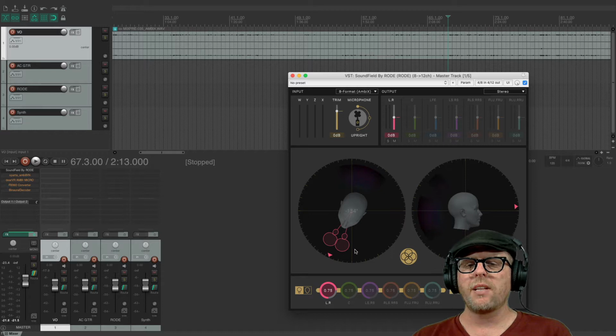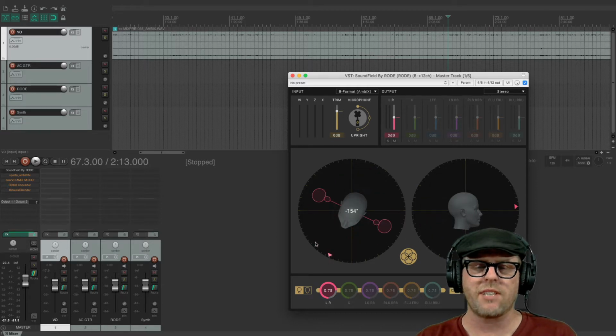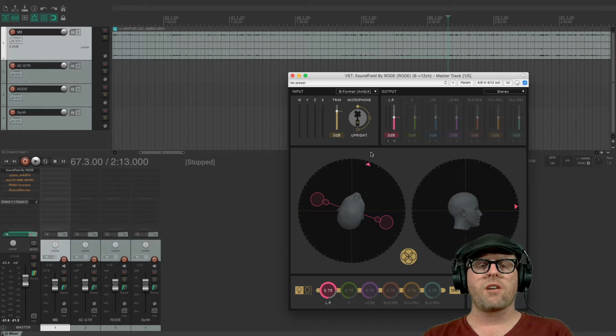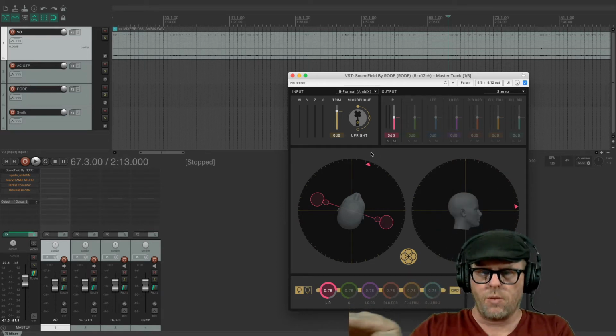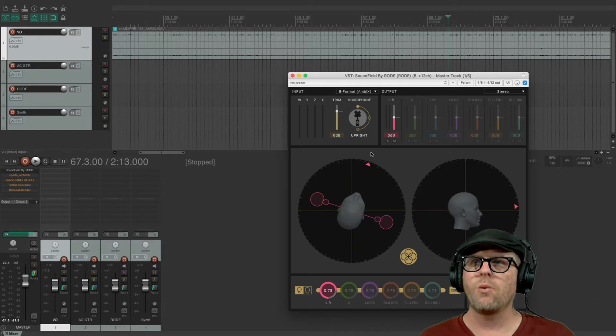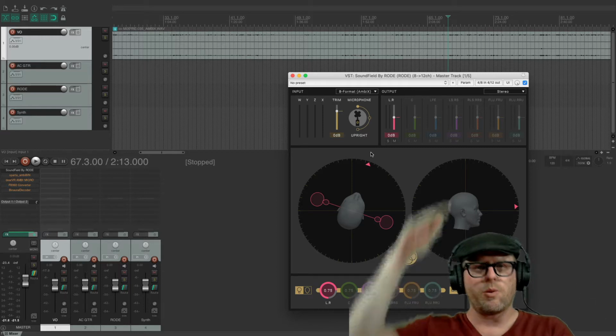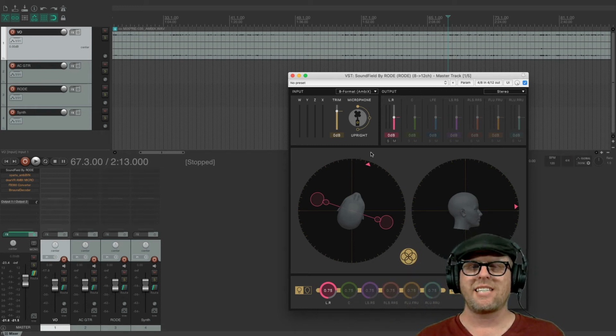So we have the ability to change the position and the polar pattern. What's cool, and I'm really excited, I haven't done this yet, is if you want to do a singer-songwriter performance, you put a single microphone up there, have them belting away, and later in post I can aim a virtual mic up to their mouth, add another stereo one and tilt it onto the acoustic guitar, and create an entire multi-track recording with a single mic. There's going to be no phase issues between those virtual sources because they're in exactly the same spot. It's the same source.